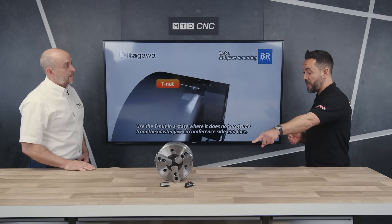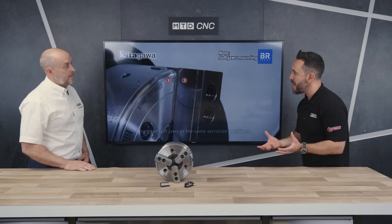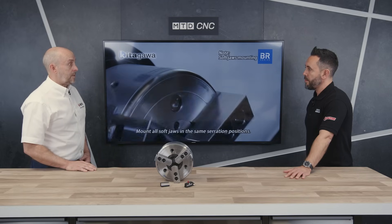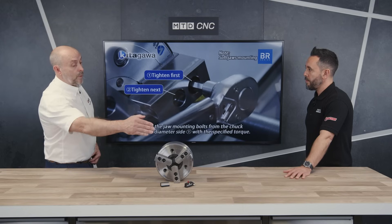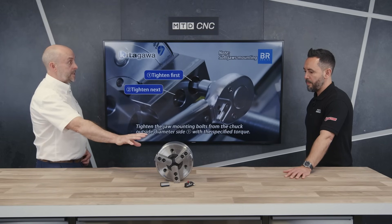And taking it to the T-nut plus — how does this work and what are the benefits? The benefits are a much smaller inventory of jaws and much greater accuracy. And with the extra addition of the small cage on the back, you can turn this into a quick change chuck. So Steve, with a quick change jaw, I'm assuming that if an end user is doing lots of setups every single day, this would save lots of setup time. Yes, it would. You've now got one chuck that is standard, quality, repeatable, and quick.